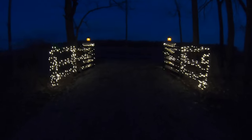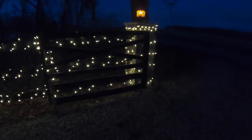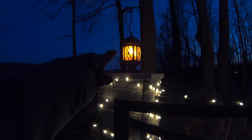And one more thing before we wrap this up, Aaron and I finally got some Christmas lights up. It's pretty dark outside. You probably can't see too much back over in here, but obviously these are lighting up pretty bright. If you missed the video where we installed these waterproof outlet boxes right here, we did one on this side and one on this side, and right now the lights are hooked up into these little $15 timers with a turn dial on them. Basically you can turn them on, off, dusk to dawn, and then there's, I think, 2, 4, 6, 8 hours that they'll run. But right now we just got them set on dusk till dawn, so it's just a photo cell, and our lights up here are on a photo cell too, but that photo cell is hooked up over at the power box over here that you probably can't see.